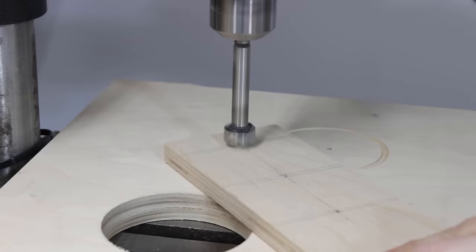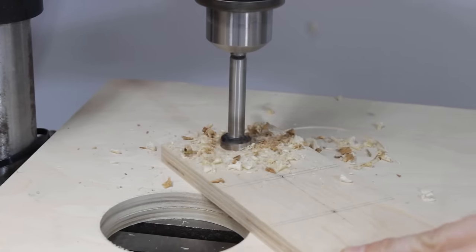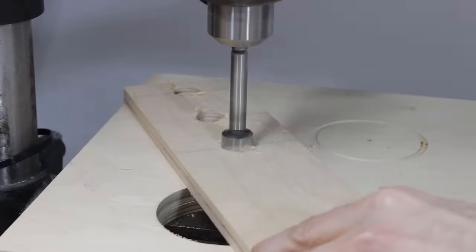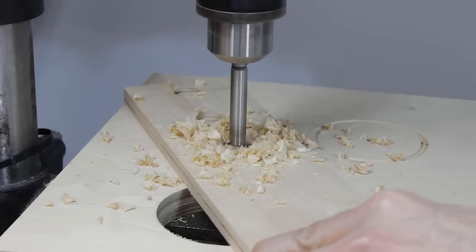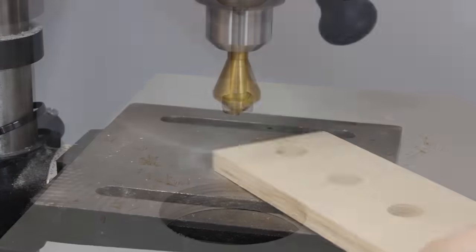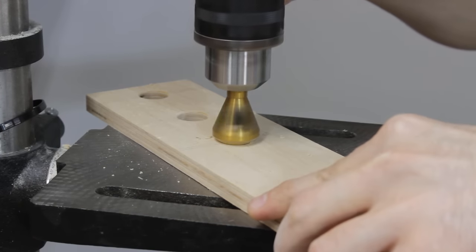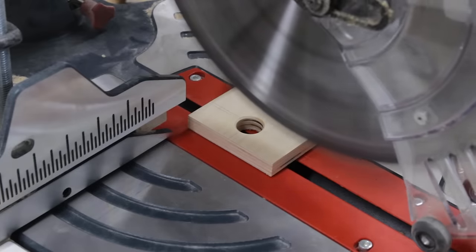On the tip of those handles, I install a small rectangular plate that is used to pull them out of the sawbox when I want to use them. I first start by drilling some round holes that will be some clearance to insert the fingers on both sides of the handle tip. And then I go on the miter saw and cut those little plates to width.